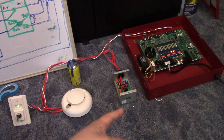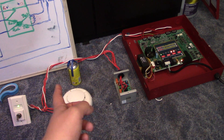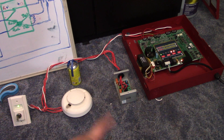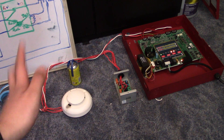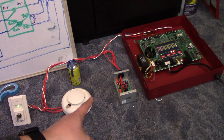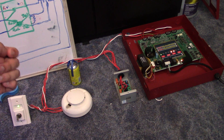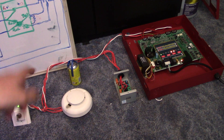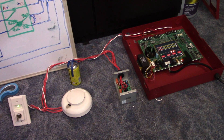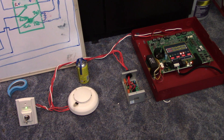What you're going to need is a panel, or you could also use a 24-volt DC source. Something that uses just contact closure to activate it's probably not going to stay latched, depending on if you want to keep it on the whole time, but that's not what we're doing today. You're going to need a relay, a four-wire smoke detector — which you would also need a relay for the end of line — and our key switch, which is the System Sensor RTS151.